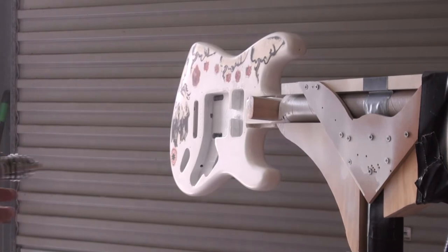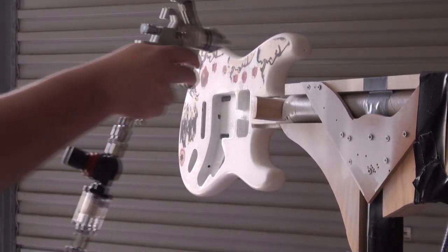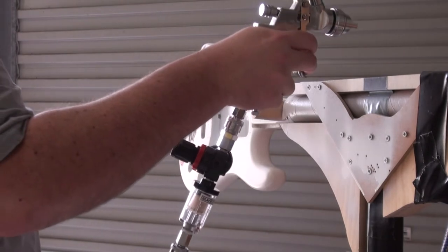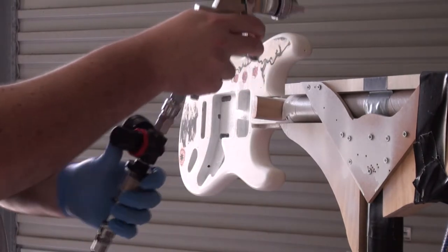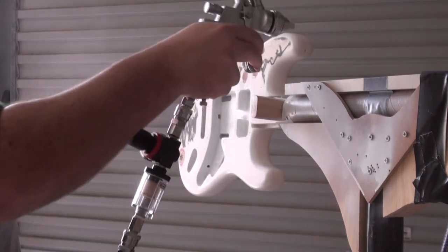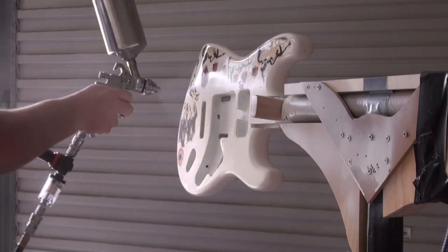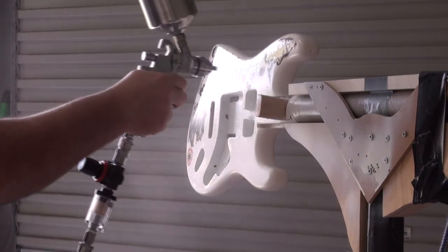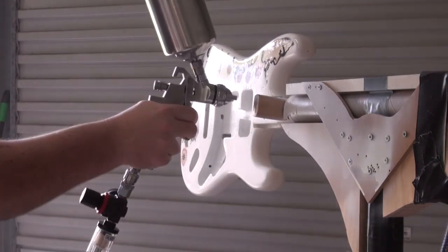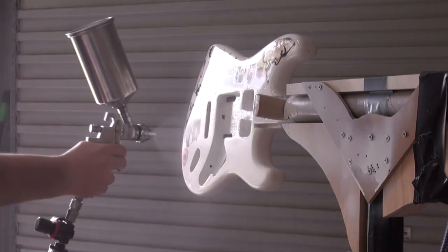Lowering the pressure was something that I was afraid to do because early on, I believed that you had to set the pressure flow to the gun for at least 25 psi, and I would just keep holding myself to this. Experience has taught me otherwise. I would have picked up this from YouTube, however they might have been using different types of guns that are not HVLP, or they were, but I interpreted their instructions incorrectly.